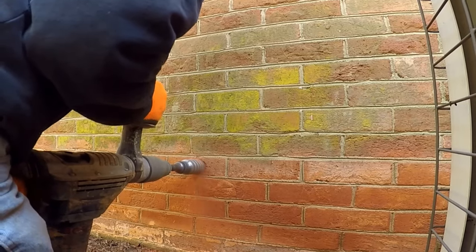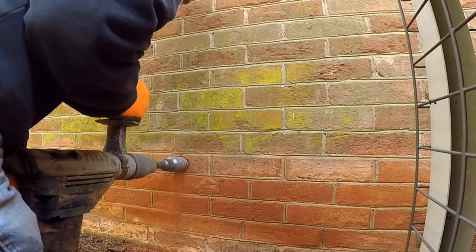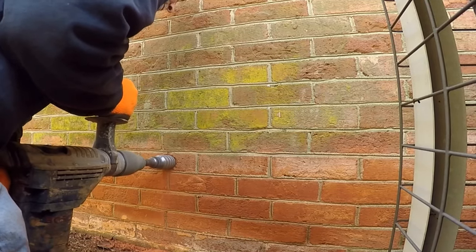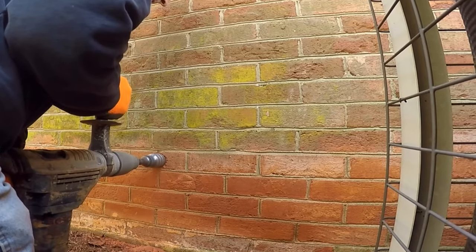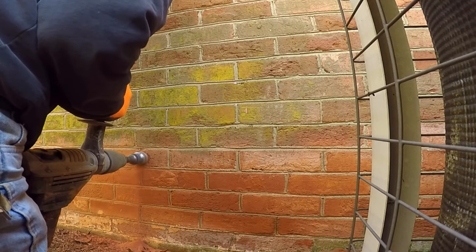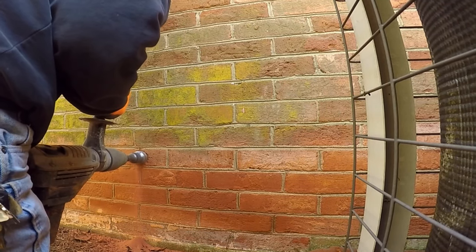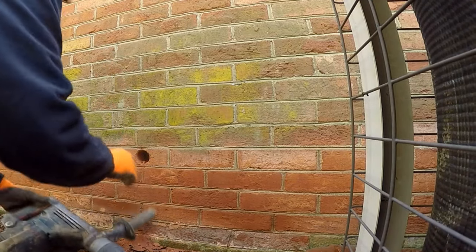I'm going to let this run so you can see how long it actually takes to go through a four-inch solid brick with the hammer drill. This is such an important part of what we do — we need to bring that inch-and-a-half pipe from the sump pump out through the wall. We don't want to send it out through a vent; that would look really tacky. It only takes me maybe four or five minutes at the very most to core through a four-inch brick all the way through. You can rent this tool from almost any good tool rental company — they usually throw in the core bit at no extra charge. The drill costs about 60 bucks for half a day, and it took maybe three or four minutes.